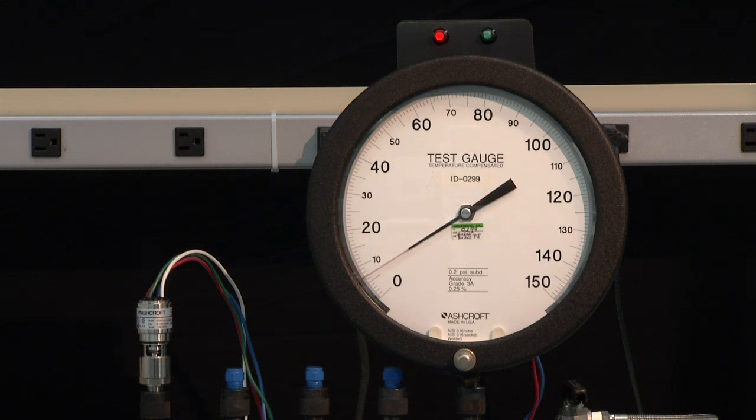We will drop it to zero, then take it all the way up to 100. Reduce the pressure to just before the desired set point, walk it down, and we should be able to see where it resets. We are a little bit low — at 18.5. So we are going to drop it to zero and make another adjustment: take it to 100, back down to 20, then adjust, and that should bring the set point closer.